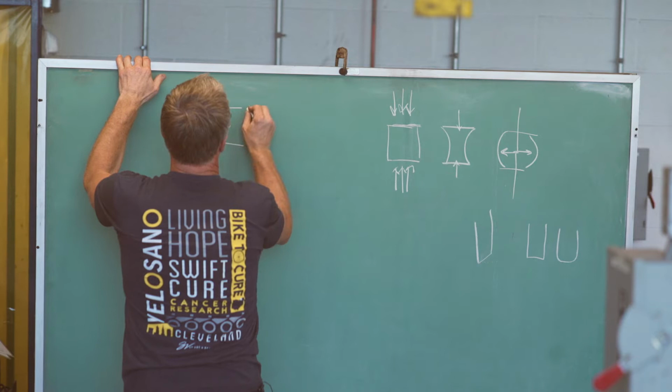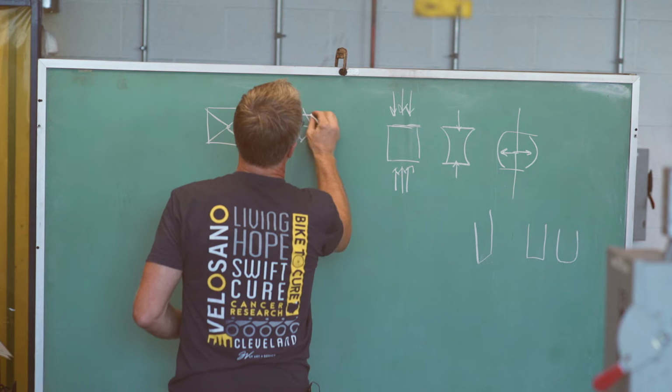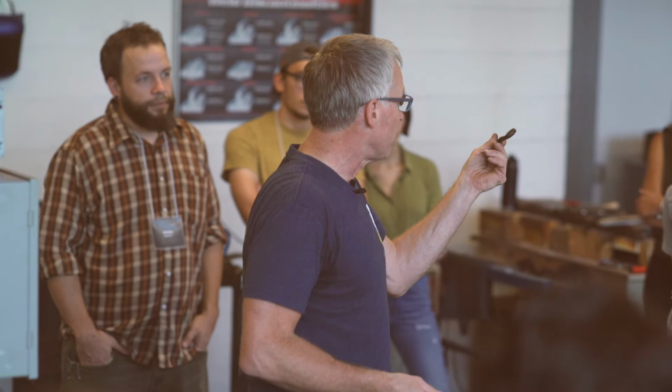So this is quarter inch square bar stock. And if you draw a long taper on this stuff and then flatten out one side. So if you, let's see, we draw our taper out and it's dead center. So when we look at it from the end, it looks like this. And then if we flip that up on the edge, like that, and then squash these two sides right here and roll that up, you're going to get this kind of thing, which is beautiful in its own right, like a fiddlehead fern. It's really cool.